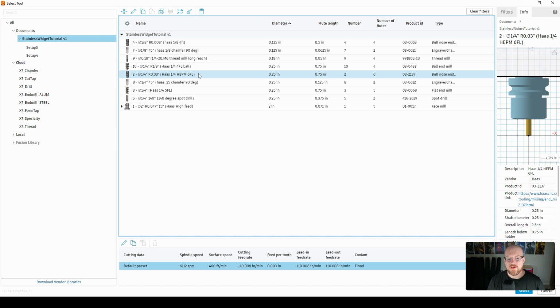If you want to talk about a mirror finish, so if you're right on the edge of the mirror and you're using, let's say a YG1 end mill, that's what a lot of people like to use to get that mirror finish. If you go from an ER collet to a hydraulic, man, it's just beautiful. It's butter.